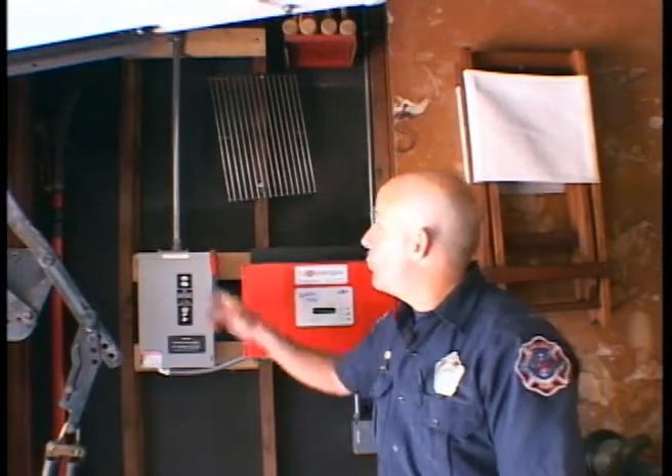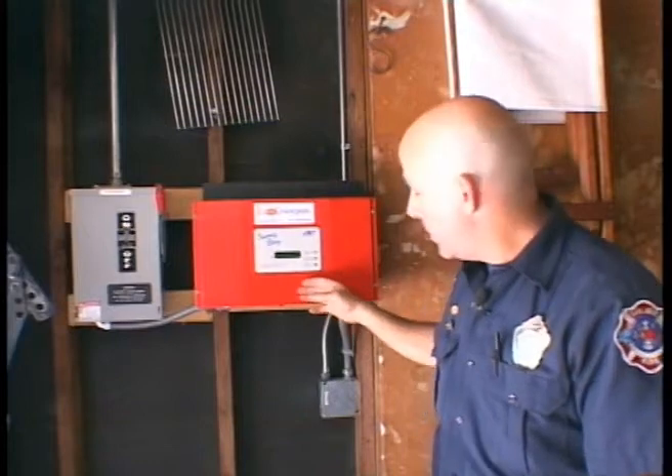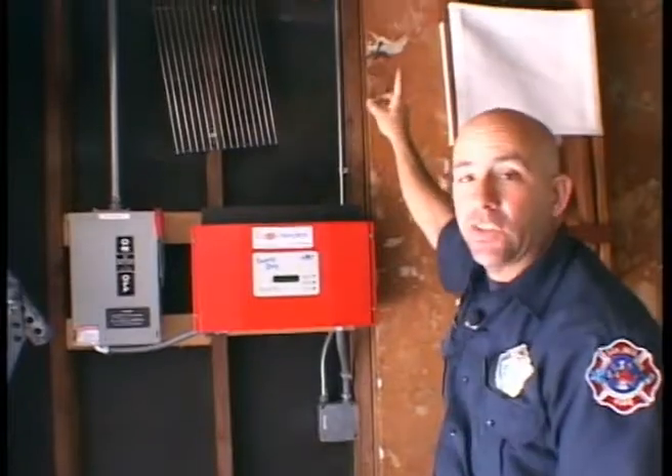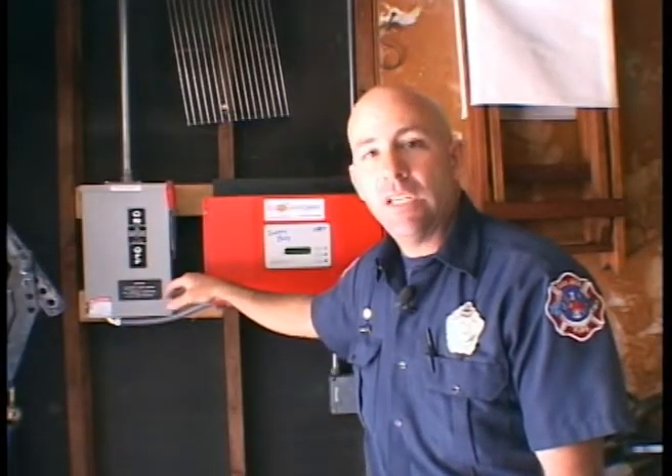We're now in the garage, directly underneath where the conduit entered the roof. It comes down to the DC disconnect and inside the inverter. The inverter converts it to AC power, and then in metal conduit it goes all the way back to the main meter and circuit breaker panel. There's a shutoff switch for the DC disconnect, but that's primarily for servicing the inverter. It's not necessary for us to shut this off — it will not shut off the power in the conduit going up to the roof and the panels. Those are always energized in the daytime. There's no way to shut that off.